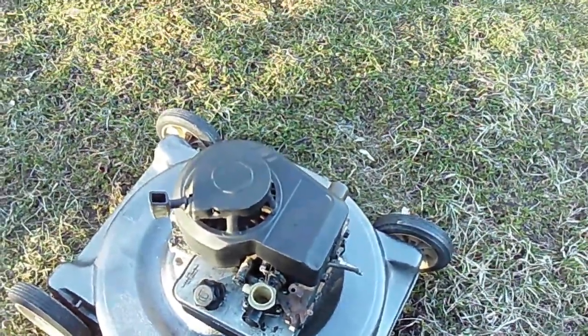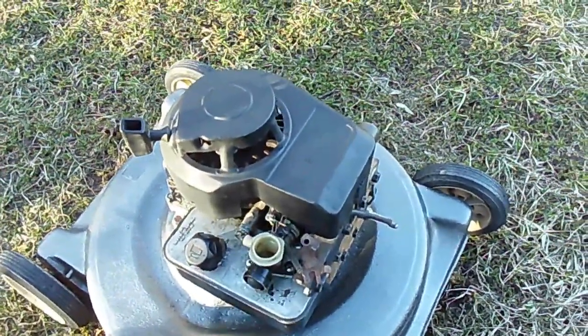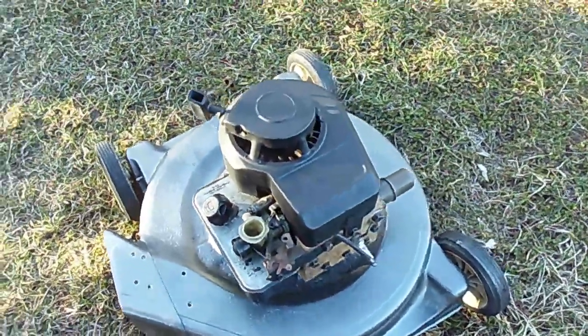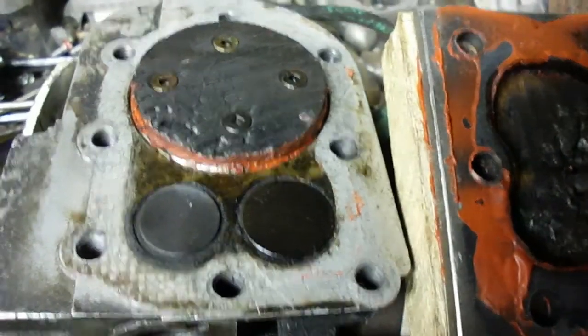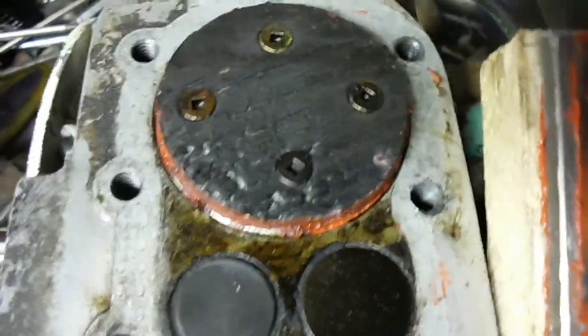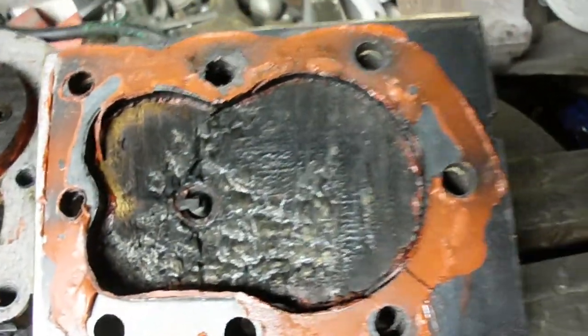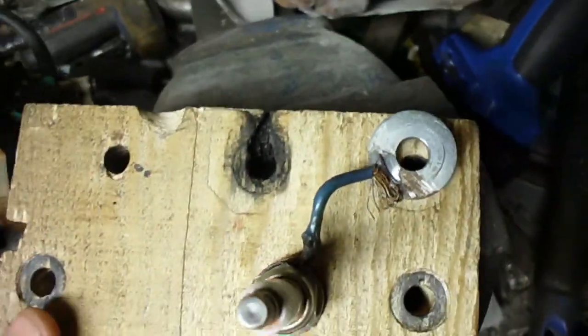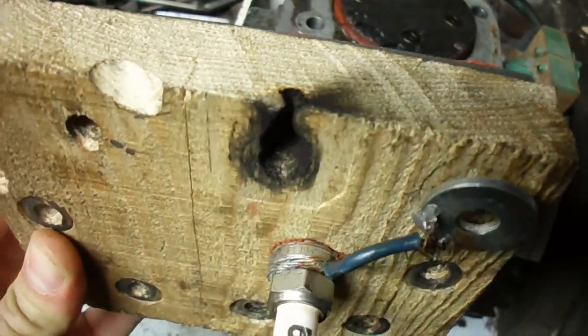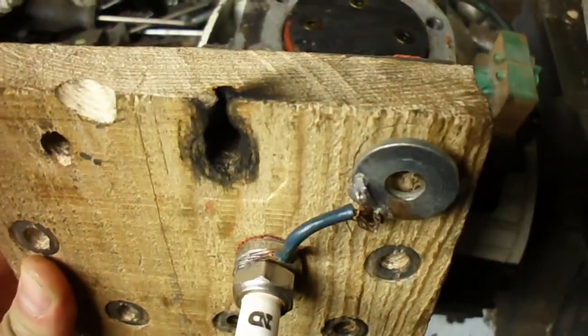Anyway, so that was the hemlock head combined with an oak piston crown. Here's the oak piston crown from that run. As you can see, it's actually not burned through. When I was disassembling it, I discovered that when I took this head bolt out, there's a burn path that leads out there — you can see the black. That's why the smoke came out the top of the motor; it was leaking around one of the head bolts.